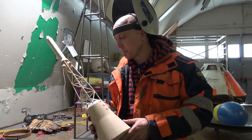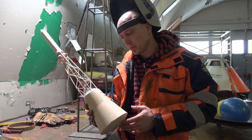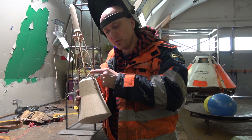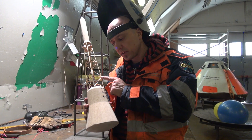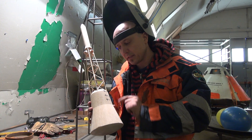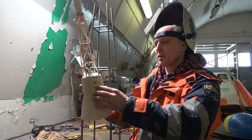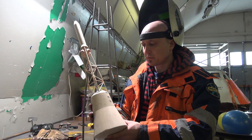We're looking forward to seeing the results of the wind tunnel testing. When the LESS engine fires, it has a certain amount of propellant which will be consumed through the burn, and that means the center of gravity will actually move when it flies. It's very important that we perform a lot of tests to see if the movement in the center of gravity will eventually hit the center of pressure and make this capsule unstable. There are certain measuring points where we will be forcing the capsule to turn about those points, simulating the center of gravity.